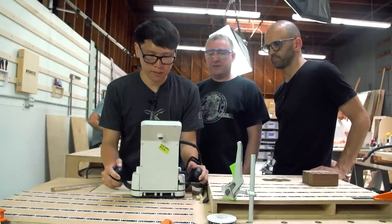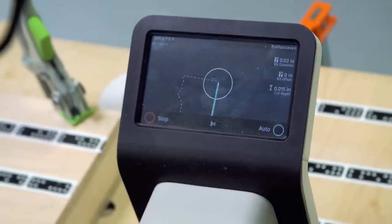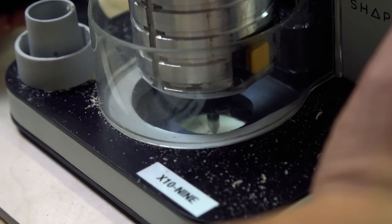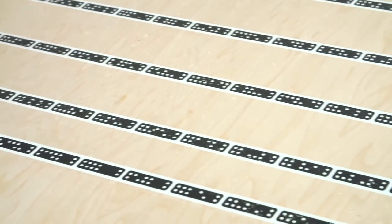I'm holding this router and as I'm literally tracing a design, a vector on the screen, there are two axes of stabilization. We use computer vision to understand where the tool is relative to the workpiece at any given time, and we use real-time motor control to course correct along the way to keep your cuts clean on that vector file. There's a lot that goes on there — things I would never associate with the CNC world. Let's start with computer vision. That's kind of almost the secret sauce behind this.